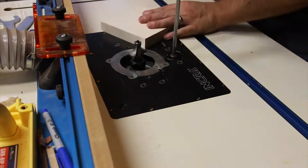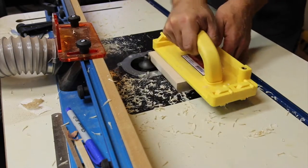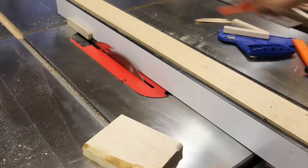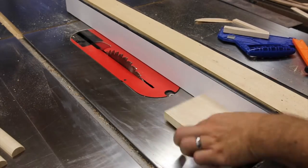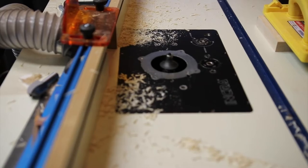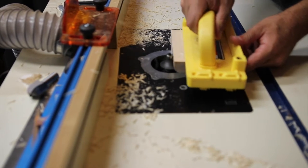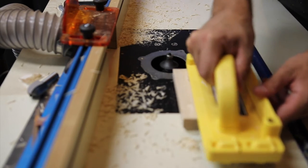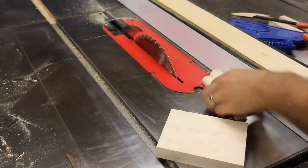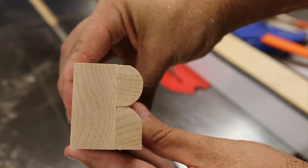Now this is the part where it gets a little more interesting and complicated — all the rounded-over sections. We're working on the B first. For this we use two separate pieces, cut them down to create the rounded effect, line them up side by side to get the appropriate width, and take those to a solid block of wood. When you look at it on profile, it becomes the B. The R is very similar to the B, except instead of rounding over both sides of both pieces, you round over both sides of one for the top crown, and on the bottom piece you only round over one particular side. When you put those together with the correct thickness as the backer, what you end up with is a nice looking R.